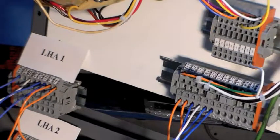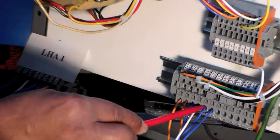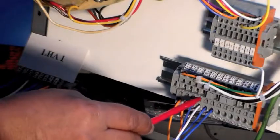We now have completed our first box, LHA1, power to our lamps using from our power adapter L1-1, L1-2, L1-3, going respectively to our LHA1 lamp hot inputs LX1, LX2, and LX3. We then used one wire for all three returns, going from our center return, because they're all jumpered common, and it will return to R1. That is the return on our power adapter.